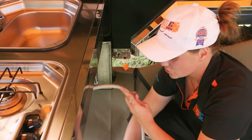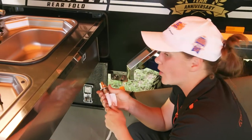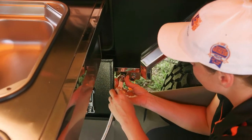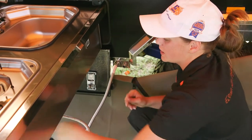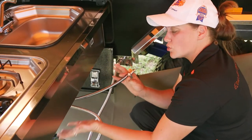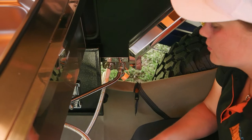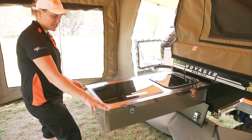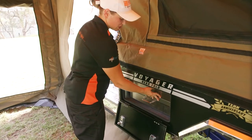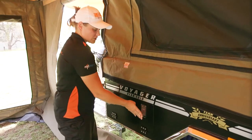Your gas is already plumbed into the trailer and you'll have gas certification for that. All you need to do when setting up the kitchen is pop in the quick connect — give it a little push and a turn and that's going to stay connected. Make sure your gas is turned on and you're ready to go. The other connection is your water — same thing, it's a quick connect, just pop it in, it clips in and stays there. Make sure your pump is on and you'll have water through to your kitchen. When putting the kitchen away, pull that out, push it in, the runners will latch in, pop it there, close it up, make sure you lock it when traveling.